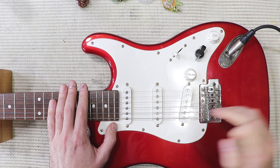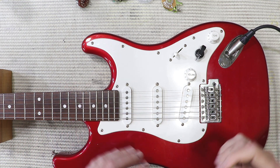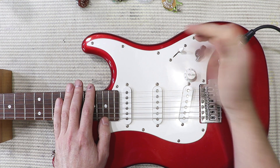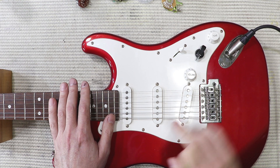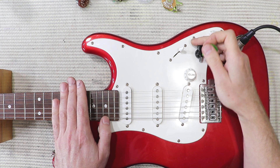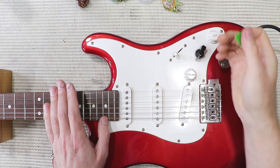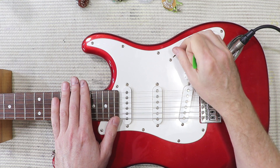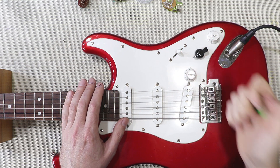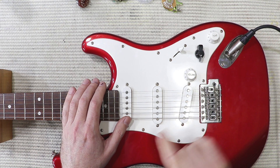That's one of the things about switching Strat pickups into series that I quite like — you get a fuller, fatter, slightly warmer sort of sound, but you don't really lose the Strat brightness. It still sounds like a Strat to me. Another way to use the switch is kind of like a series/parallel switch. So if you have this in position two with these two in parallel, this acts as a series switch. You can do the same thing in position four with the neck and the middle — parallel and series. It's a really nice option if you're perhaps the only guitar player in your band and you need that little volume boost and a more mid-range sound, especially with drive pedals.